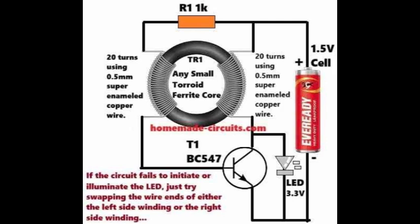This circuit avoids the issue of wasted power, allowing the LED flashlight to function with a single 1.5-volt AAA cell and remain lit until the cell is completely drained. These features make the proposed LED flashlight significantly more efficient, long-lasting, and economical. For even brighter illumination, the LED could be positioned inside a polished reflector base.